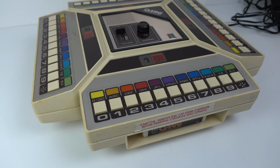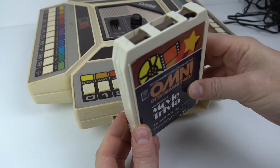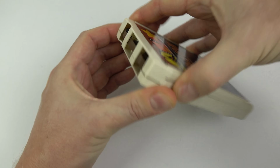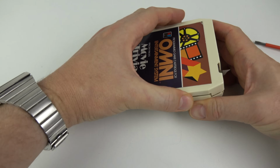2. Kelly and Me. So I'm still hearing 2 tracks at once. Well, I'm pretty sure the machine is fine now, so it's got to be something wrong with the 8-track cartridge itself. Now, I've repaired plenty of these over the years. It's just a matter of figuring out how they open. There's quite a few different ways. With this one, it's just some plastic catches which have to be moved out of the way.